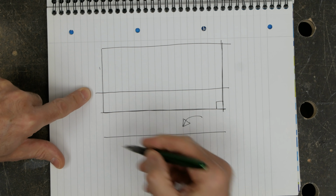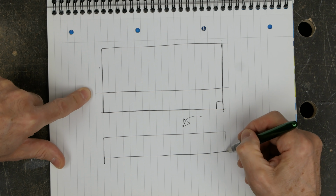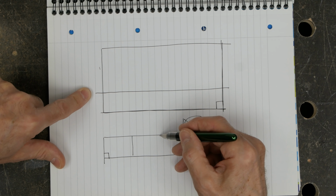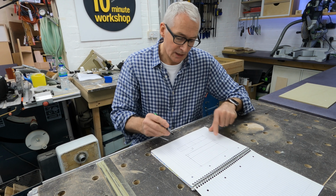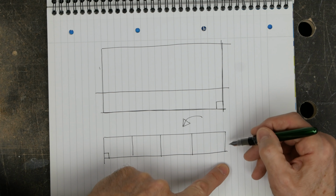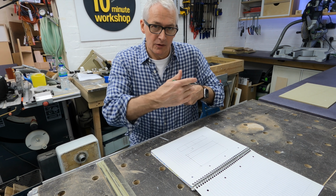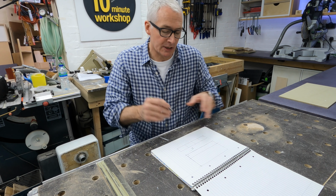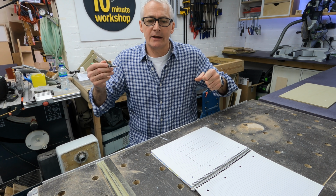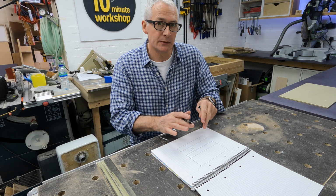So we've got a 2440 by 400mm rip with one square edge, and then we can do 600s off that. And the reason I'm doing it that way is because with a 400mm crosscut, there's less chance of any sort of deviation off square than there is on a 600mm crosscut. It's just a subtly different way of working with it, and it's just the way that I've always done it, and it's always worked well for me if I've needed to do that kind of thing.